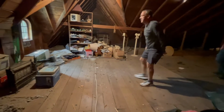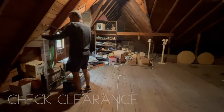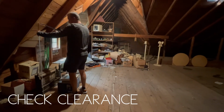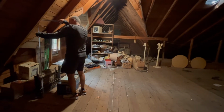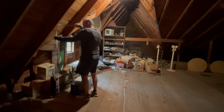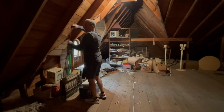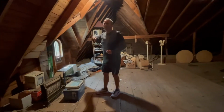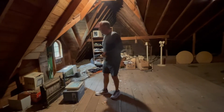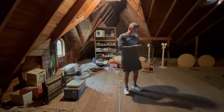The other thing about the bedroom space is you've got a minimum height. 80 inch. We can put in some knee walls just to make it not feel so awkward. I don't think you have to. You just leave it. Or we could even build in some shelving or cabinets or something to just make it useful. So those are 2x6s. Let me look at my span tables real quick.